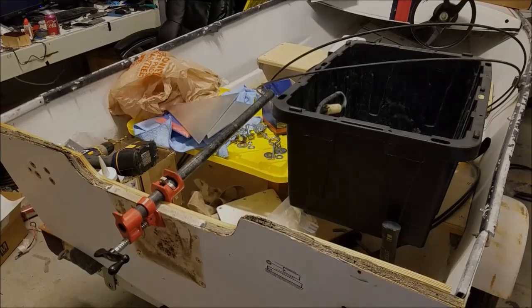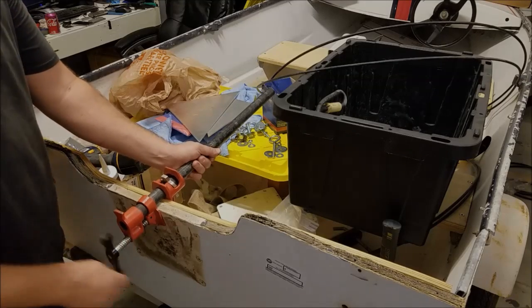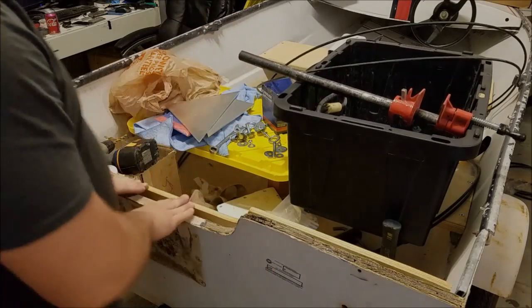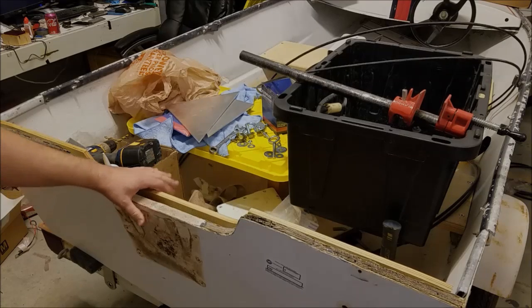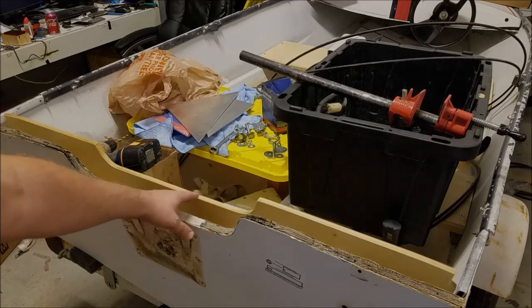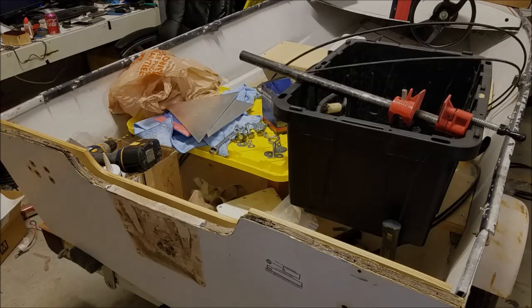Alright, my little boat here has become a pretty good shelf. But I'll show you what I have ready to go for it. I have a little transom band-aid made up. It's not really a band-aid. The transom is pretty strong. The problem is it's not thick at all. I need a little more meat to it. So I got this cleverly cut up piece of Baltic birch here. Plan is to liquid nails it in and then bolt it in.